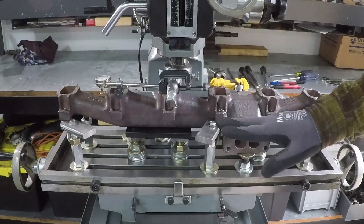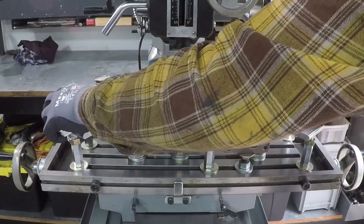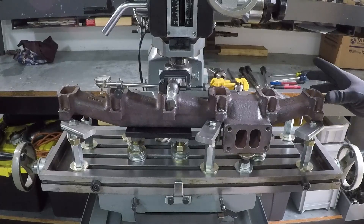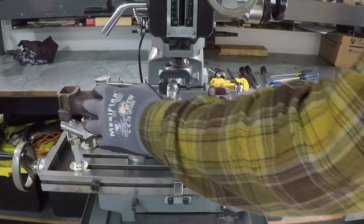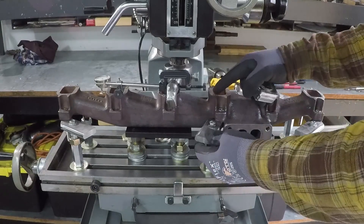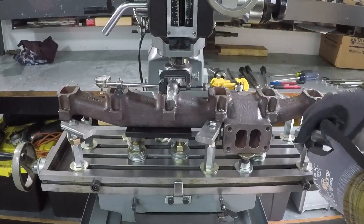The way I do it: I set it snug on the outside ports and shoot for a zero reading on one of them to get zero on both ends. Then I move the table and set it to zero on one end — the other end is negative five. I left it snug and then mapped all the ports: which ones are positive, which are negative, and by how much. I wrote this information on the manifold itself. Then I set the dial indicator in the middle and tie it until I achieve the number I wrote, using the dial indicator.